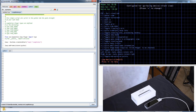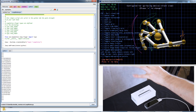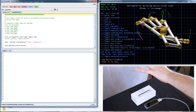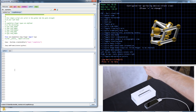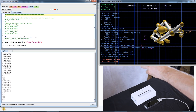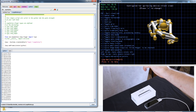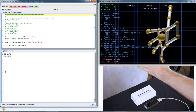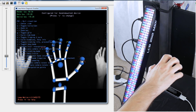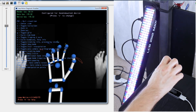The other thing I've had in a box since playing around with virtual reality is the Leap Motion — a little hand-tracking sensor. You can see my hand is fairly well tracked with all the bones solved. My Robot Lab also supports this, so we can pull out all the joint data. I've got a sample script measuring joint grip strength — how much the joints are closed — going up quite granularly all the way to 100 as I close my fist. We can map that to OSC to control something else; for now I've patched it to the intensity of a light and you can see the fader moving on the virtual console.